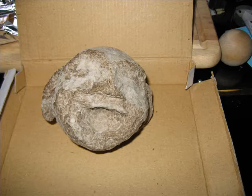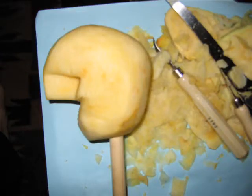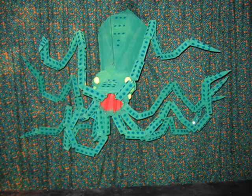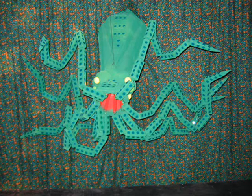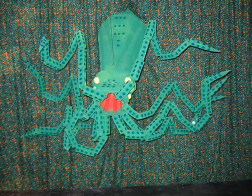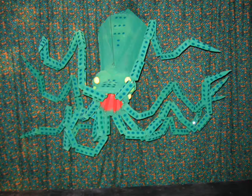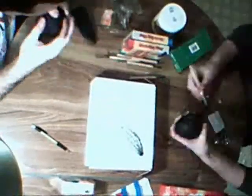What we did is we made plasticine originals, and then the idea was to cast those. Some thoughts going into this: we don't want to do undercuts — areas where the liquid plaster we pour for the first part of the mold goes over top of our original — otherwise we have to destroy the original or any subsequent castings to remove it, which defeats the purpose. We're doing this in two parts: first the face as one mold, then the back of the head as another, with features to make the two molds marry together well. This is all time-lapse photography — 151 minutes of us monkeying around.